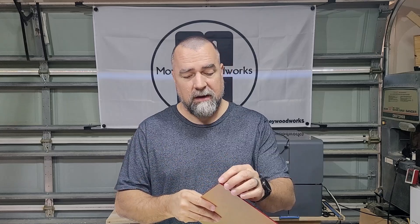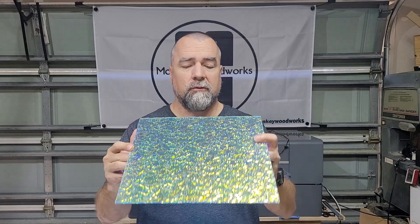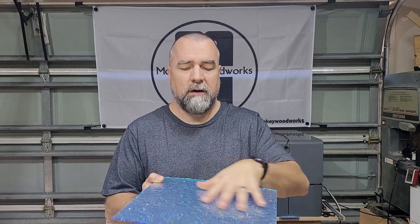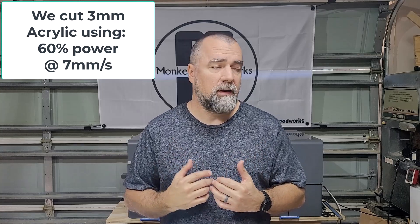This one is actually hot pink — if I pull this back you can see the hot pink revealed underneath the paper. They also have textured acrylic; if you rub your hands on it, it actually has bumps — looks sort of like ice. For all the pieces in this video we use three millimeter acrylic. Whether it's clear, glitter, or textured, we use 60% power and seven millimeters per second. If you go too fast or too hot it'll cut and then as it cools it'll weld back together. The 60 and seven mm/s gives it enough time to cut and separate so it won't weld back together.